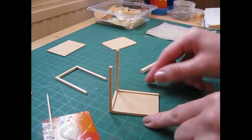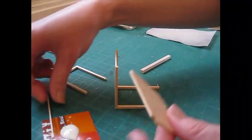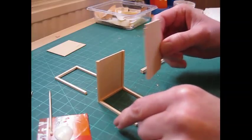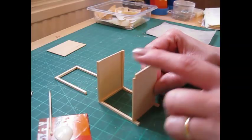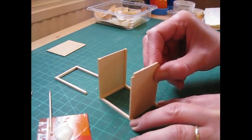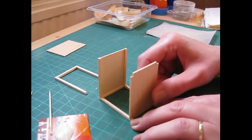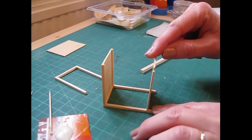And then just very carefully turn that piece onto its side. Bring in your shelf piece and just apply a little bit of glue into each of those cut out corners. And then we're going to attach this so that it sits just above those pencil marks down there. So put it into place like that, and then just squeeze those sort of bottom of the legs together like that. Try and keep it as upright as possible, but we will square it all off when we attach the remaining legs. That piece can now be left to dry for a moment.